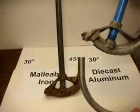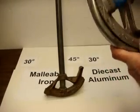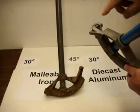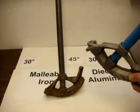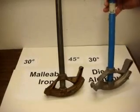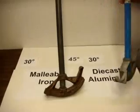That is not true of some of the other die-cast benders. If you were to line it up, you are off by at least 1/4 inch and sometimes 3/8 or 1/2 of an inch. It's very difficult to subtract in your mind a fraction of an inch when you're trying to just do it visually.